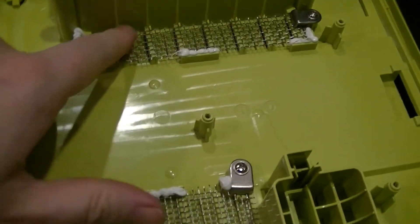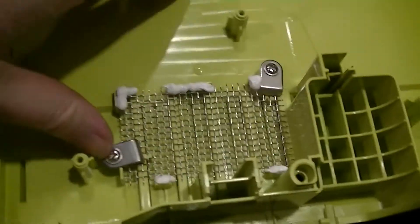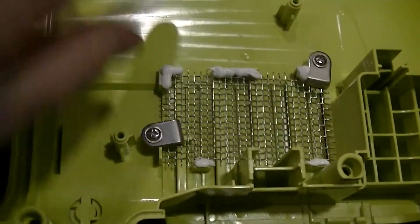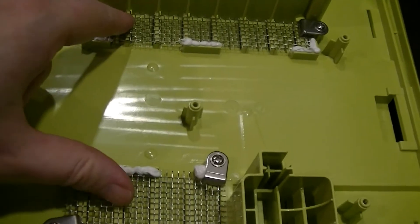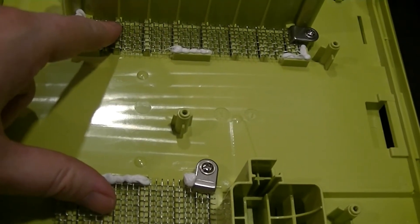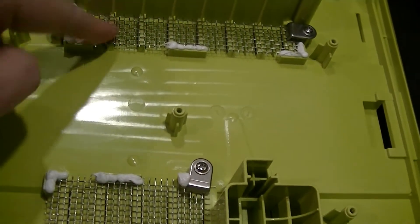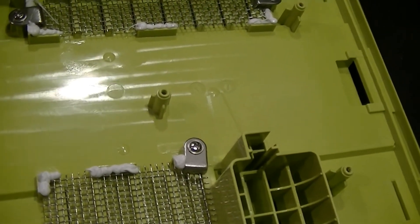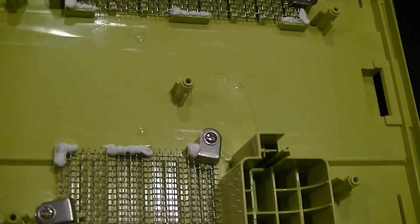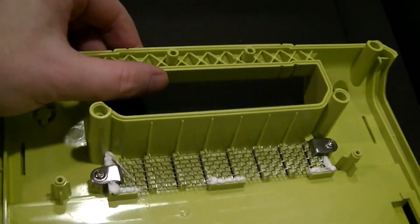One last interesting thing of note: there's a wire mesh that's been silicone-sealed and screwed down with brackets over the ventilation holes on the bottom of the case. That's a good design touch because this is going to be used on job sites, and debris getting in could damage the underside of the PCB — there's all kinds of delicate stuff just about a quarter inch from these openings. The case is polybutylene terephthalate — not glass-reinforced, but that isn't strictly necessary since this isn't a beat-things-over-the-head type of tool, even though it is designed to see some use, as evidenced by the reinforcing cross-hatching on the handle.